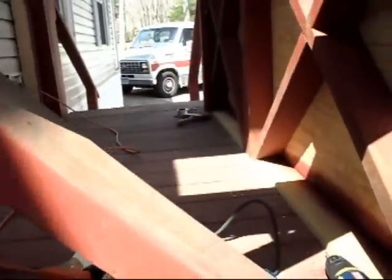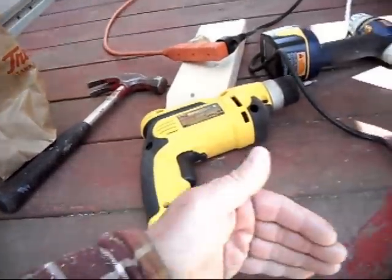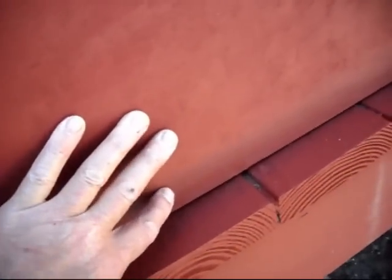Then down at the bottom, I don't have any pressure-treated 2x4s, but I do have pressure-treated 1x4s. So we're going to take it, like we did here, we're going to put the pressure-treated 1x4 here. That'll give me a support for the bottom. If you notice here, I did not nail in that 1x4, and that's simply because I don't want to make any holes in this plywood. I will do all my nailing on the piece that's going to go in here, and that will hold it tight against the building. Yeah, we'll stick the camera in the dry cat food container here, and you can watch me do a little work here maybe.